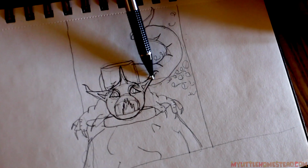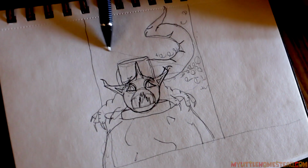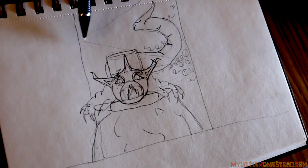We're going to run the pipe from the rocket stove down here where the firebox is. Inside the wall, the stovepipe will come up in zigzags and then out the back, and we'll store all the heat in the wall. The tail will go up on the wall, and it'll kind of go this way up into the top so that we can actually decorate the wall that's gonna store the heat.